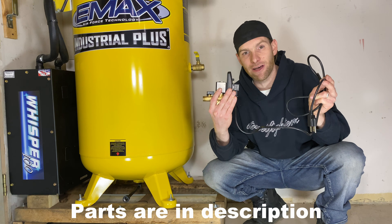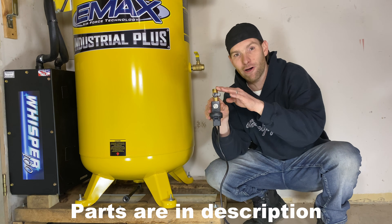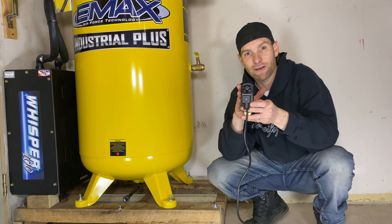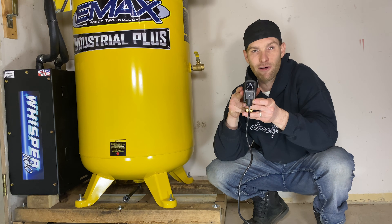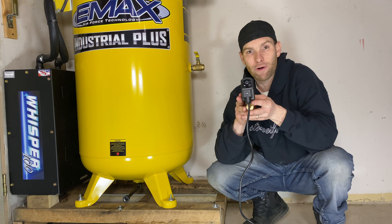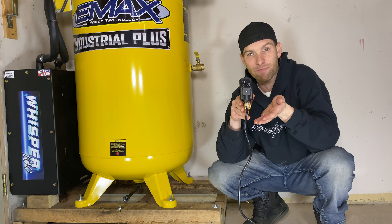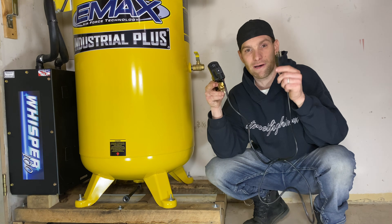Or you can use an automatic tank drain valve. The automatic tank drain valve still has a manual shutoff in case you want to turn it off before you get to the automatic part. But if you're going to use the automatic part, you want to leave this turned on, which is in line with the pipe. You're going to base everything off the time intervals. On this side you have seconds, on this side you have minutes. The seconds is how long you want to keep the valve open to drain it, and the minutes is how often you want it to open that drain valve. You can set the seconds from as low as a half a second all the way up to 10 seconds, and the minutes from every half minute all the way up to every 45 minutes. And if you don't want it to go off at all, you can just leave it unplugged.